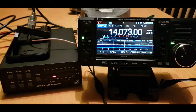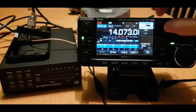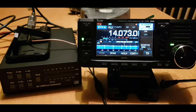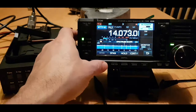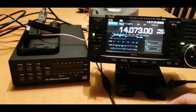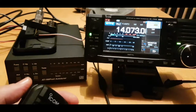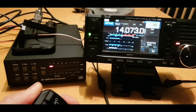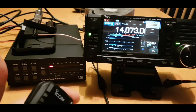You can see, as soon as I've keyed, the tuner's trying to kick in. I haven't got the Icom cable for the tuner, so I have to rely on just keying and pushing buttons. At the moment we're on half power, so let's put on 50. Keying up and you can see the tuner's doing its job. Let's put on the meter - keying up again, the SWR is showing. Let's try again at full 5 watts - it's 1 to 2.8, so not brilliant. I could do with better earthing on this.